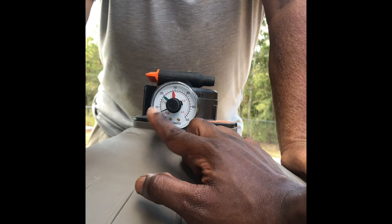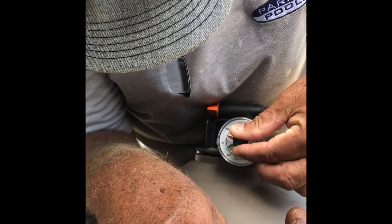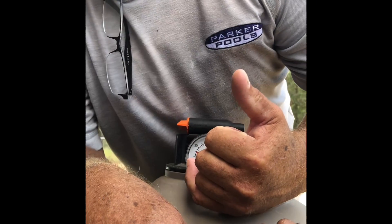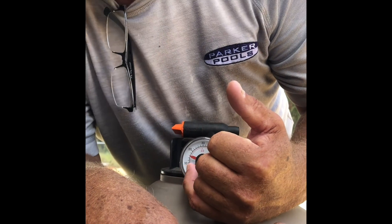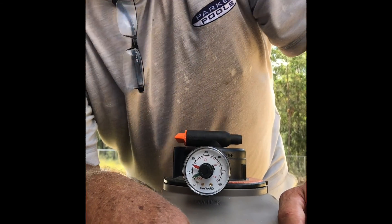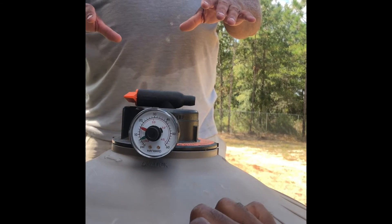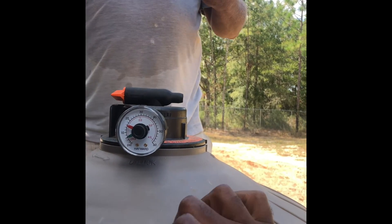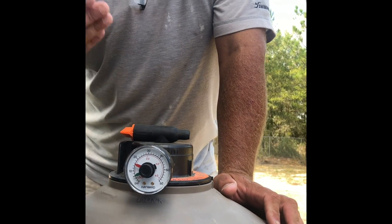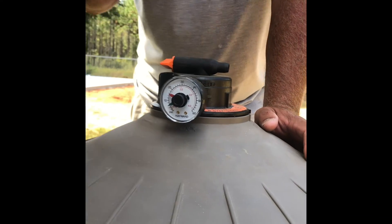It's a red, green — what's the black one for? The PSI. So what it's telling me — I'll put the green over the black — that's what your PSI is. So when it starts increasing and hits up here to the red, it's telling you that the more pressure in here, the less it's filtering. The filters are getting clogged up. It should run real low PSI. When they start getting dirty, the pressure will start building up because the water is restricted, it's not flowing as good.